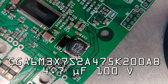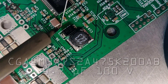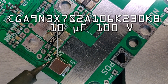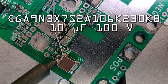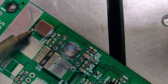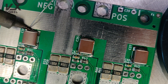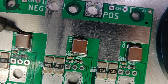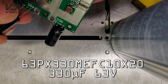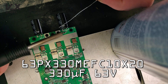Let's continue with the capacitors. There are quite a few of them and there are different ones. Align those with the white line on the PCB that shows the negative pole of them, and solder them on both sides of the PCB.